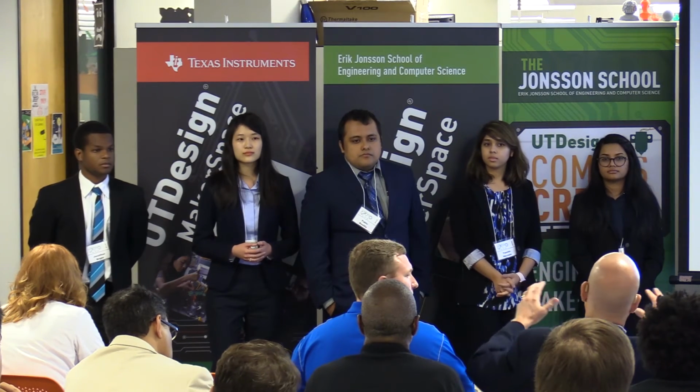So would you use this in a manufacturing environment to test motors coming down a production line? How would you use that? Yes, you can. It's mostly used in a test setup. Say TI is designing a stepper motor driver, and they want the current to increase as you need more torque, or decrease if you don't need as much torque to save power. It would be used mostly in that setting, or it can also be used to get motor characteristics and test stepper motors.